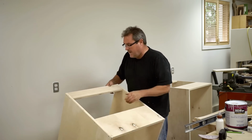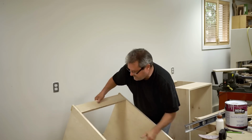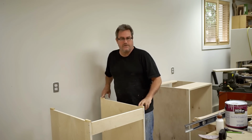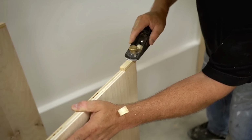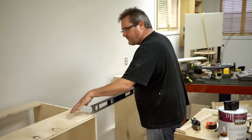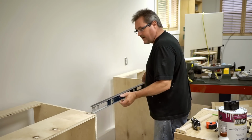And that's to add these, just gotta flip this over, blocks to the bottom. These are just pieces of softwood, and they'll be what you could call permanent shims. What I'll be able to do with them though is plane them down to fit. Before I do any leveling, I've put these exactly where they're gonna go, 46 inches apart in my case.